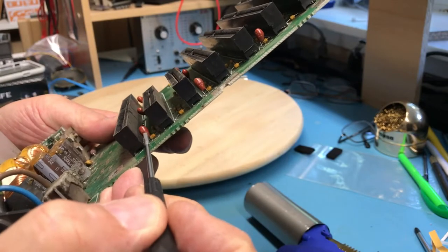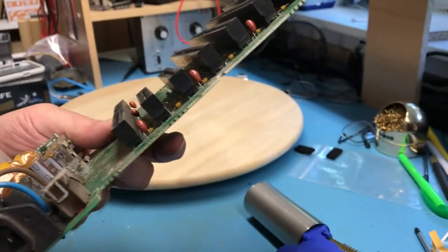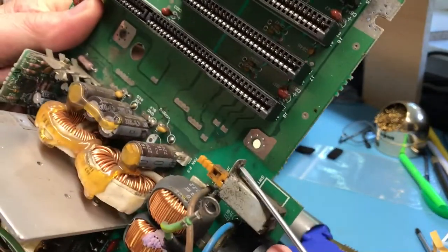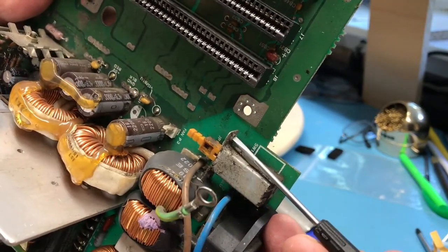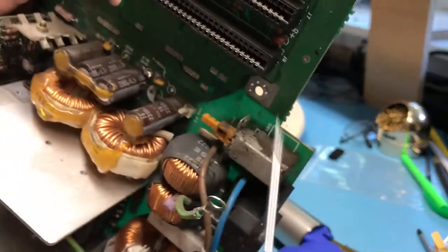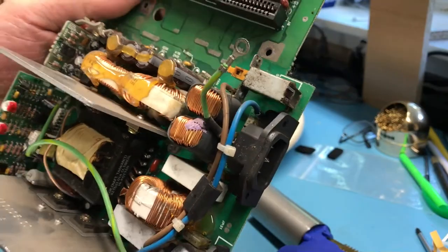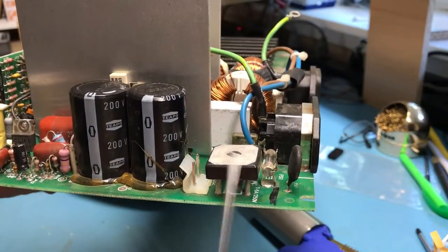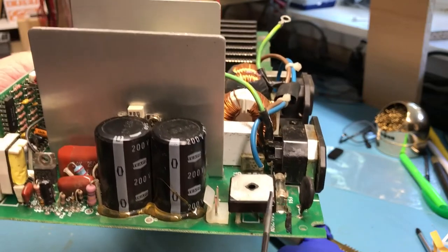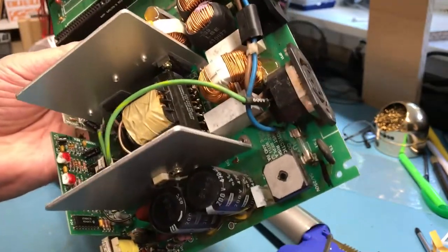Tantalums I tend to salvage, but that doesn't mean they're good. I'll debate whether to do that on this board — again, they're 31 years old and may not be worth it. The main power switch has a couple of ears for panel mounting with threaded holes. I would salvage this; the switch mechanism feels good. The fact that it can be panel mounted makes it a useful switch to scavenge. There are semiconductors too — a diode bridge here. It might be bad or good; the bridge can be pulled and diodes tested, but that doesn't necessarily mean they won't break down at a higher voltage than the meter can produce in testing.